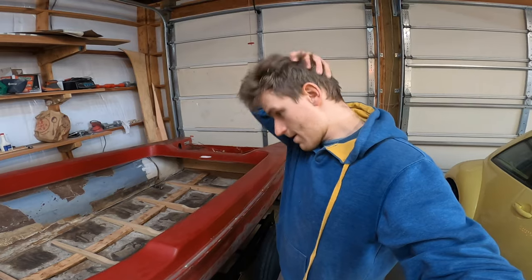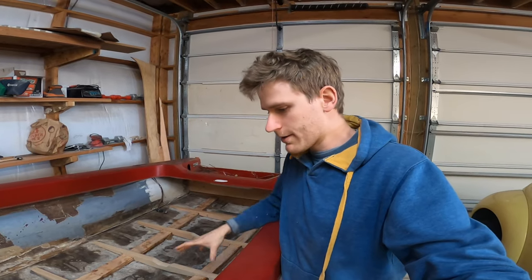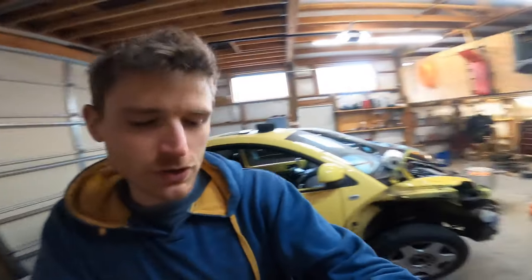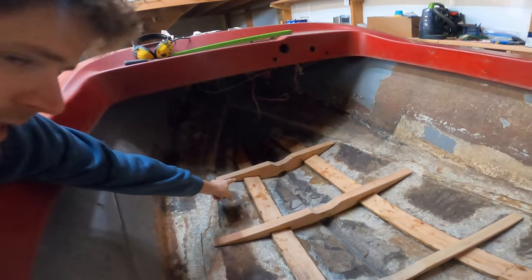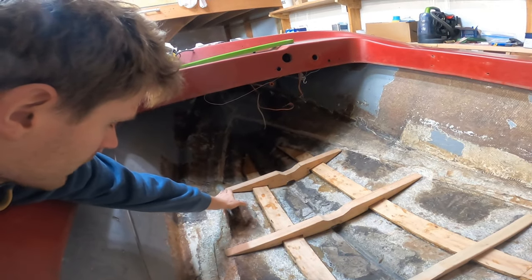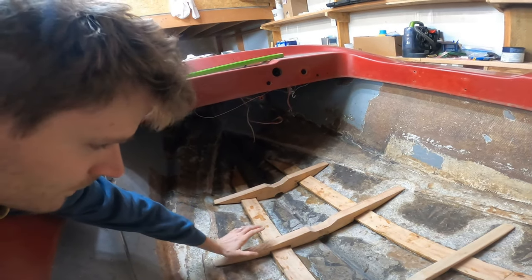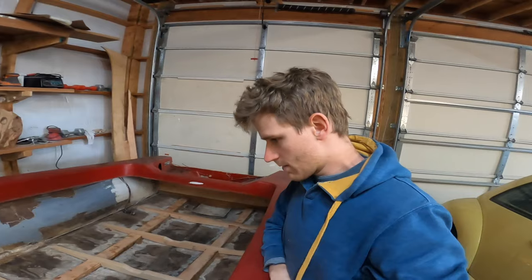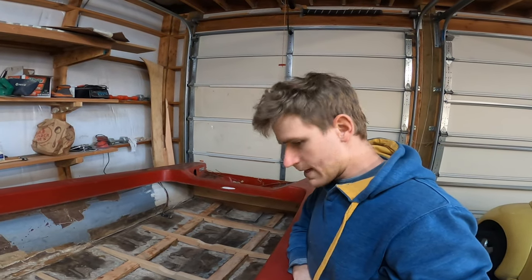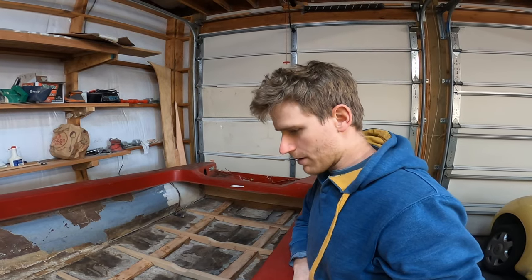So I'm gonna prepare all the fiberglass, get it all mixed up. I'm gonna mix it a little bit thicker than I did with the runners, especially with the front stringer. I think that if it's a little bit thicker, it won't run out. I want it to stay in place when I have them put in. So let me get that done and let's finally get these things put in properly.